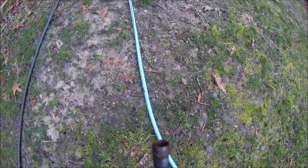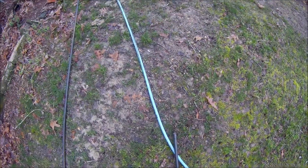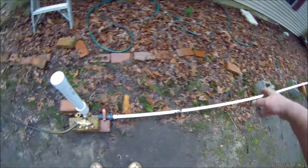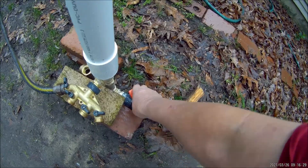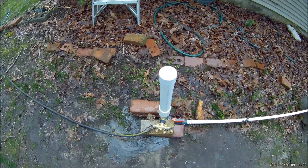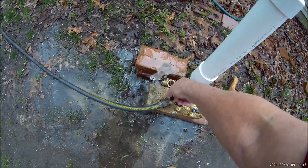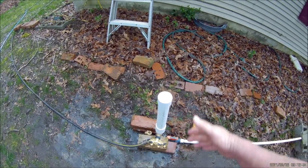I've disconnected the long black hose from the shorter blue hose. The hoses are empty — there's no water in them at all yet. I'm going to open up the ball valve that will allow water to flow from my reservoir through the drive pipe down to the pump. Right away my pump starts pumping because of that vertical design, but whatever pumping it's doing the water's not going anywhere, so I'm going to go ahead and open up the delivery line going downhill — that should stop my pump immediately. Yeah, it did, because there's no back pressure on the system.